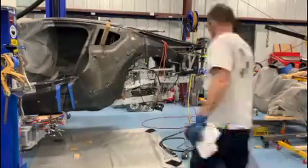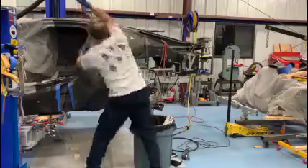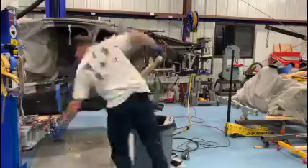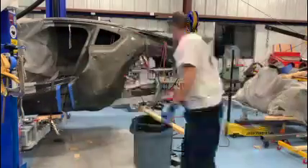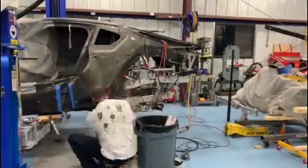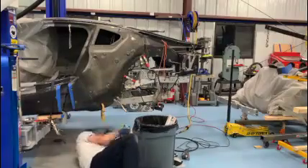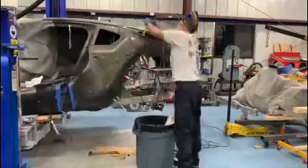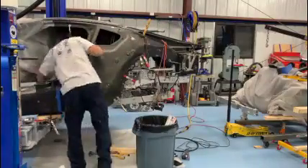Then I start wiping out some of that extra squeeze-out that came out of the joint, clamping it into place, and ultimately I use a couple of tie-down straps to keep pressure against things while the epoxy dries. I also used a couple of little wooden blocks pounded into place to shim everything up and keep it nice and snug.